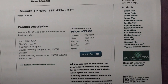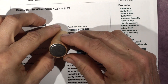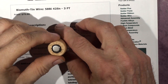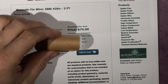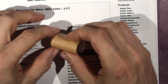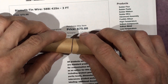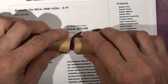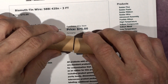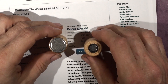I wanted to connect up some of these nickel metal hydride batteries — actually these are nickel cadmium, they're old cells but they seem to be okay. Let's go with my very favorite Panasonic electric screwdriver. Obviously these two need to be connected together; on the actual product there's a spot welded steel strip which is spot welded to each terminal.